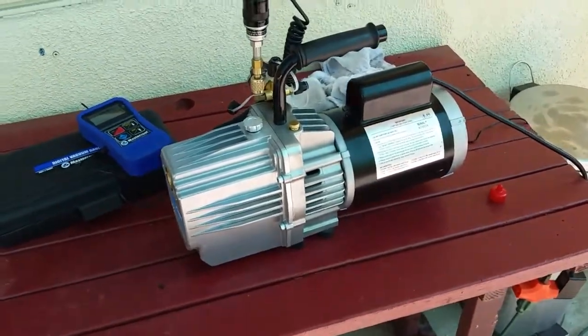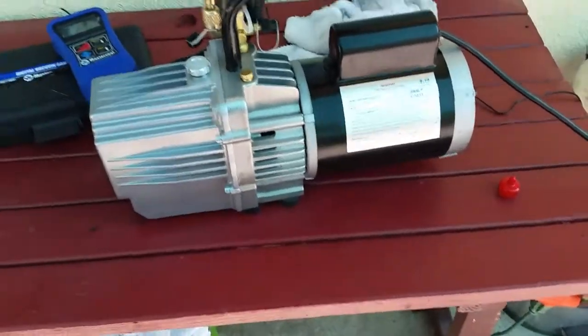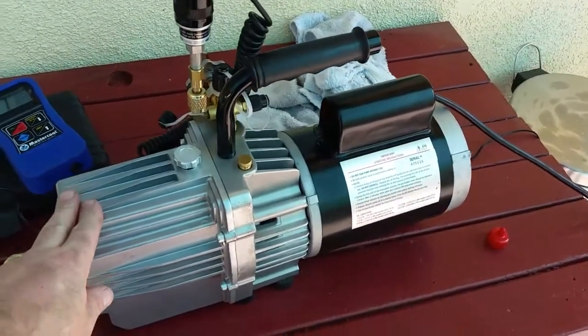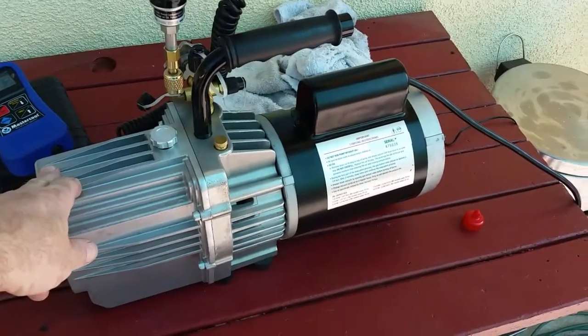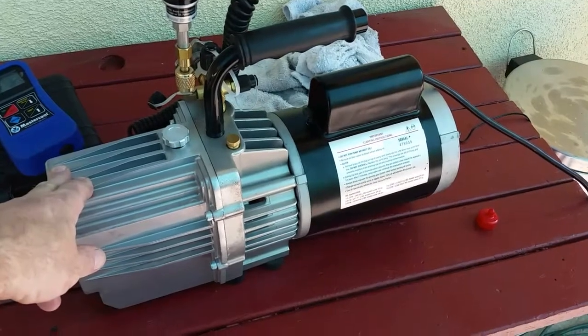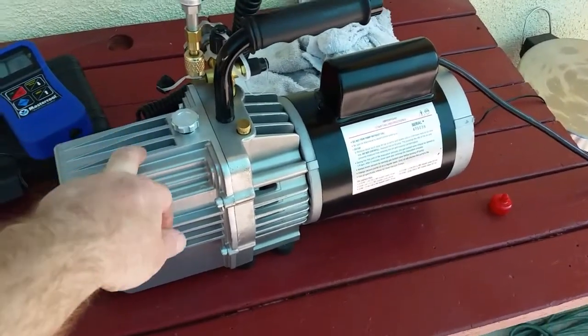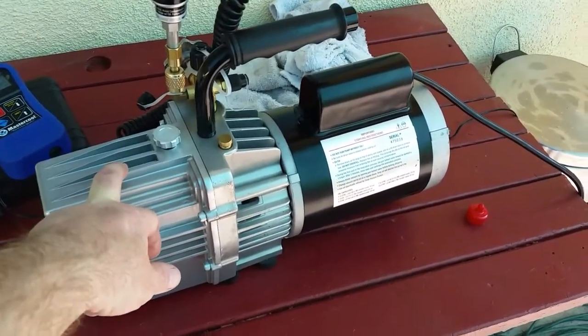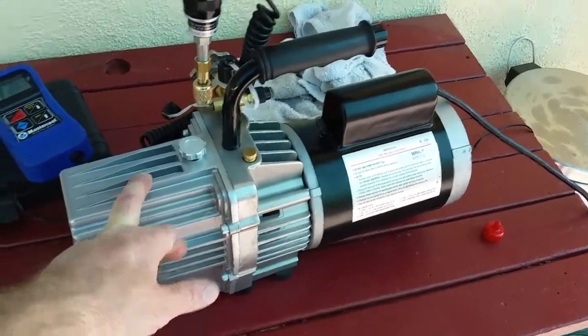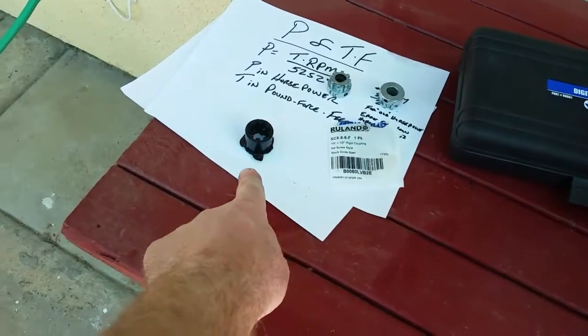Like I said, the locked rotor peak torque of this motor, being brought from operating speed to standstill, would only be 72 inch-pounds force. 72 inch-pounds force. And this steel coupling is good for 4 times that, or nearly 4 times, and it's impervious to heat. As we all know, plastic is not.